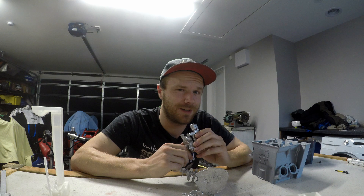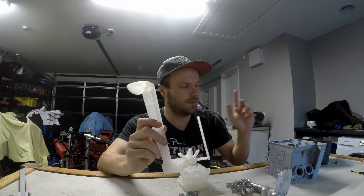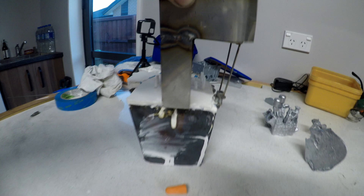The last thing I took away from the last video is heat, especially with preheating the molds. The molds needed to be a lot hotter to help fill in the intricate parts on these cylinder heads and not have premature solidification. Now that we've got this all printed, I just have to glue the cylinder head to it and stick it in the mold. A little bit of tinkering later, we have ourselves a three-piece mold — two pieces assembled with a bolt, and then the last piece goes on with a little bit of tape to hold it in place while the investment cures.